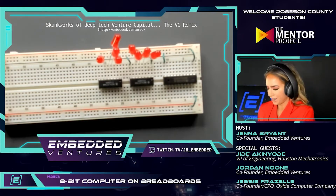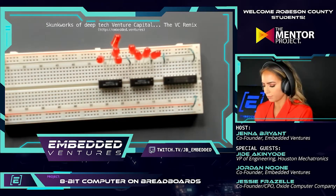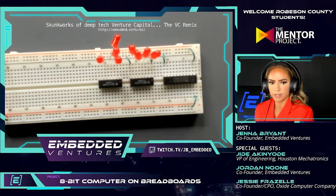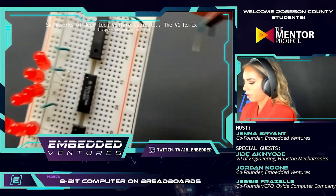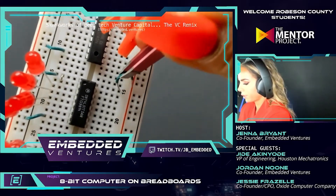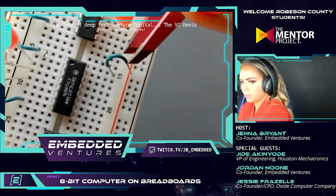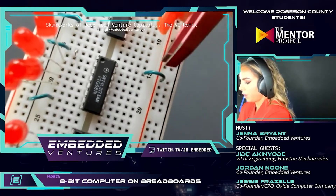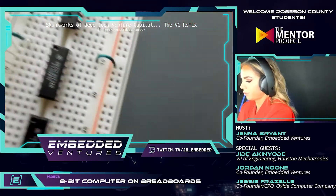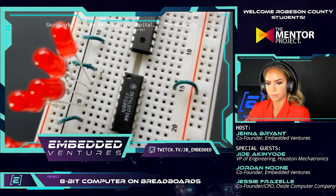I think I might have overdone this wire, let me grab my tweezers — we're calling them 'tweezies.' I'm connecting pin 16 to power, so that's going to be all the way up here. We want it kind of towards the end because it's like keeping those middle ones free. Power is — yeah, perfect! So we finished that chip, and we need to do the same thing on the other one.